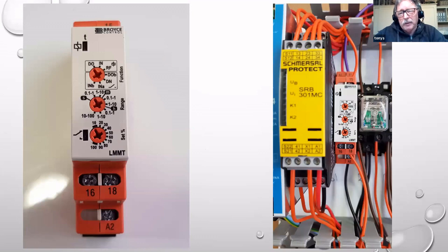That's the design principle of this watchdog timer - it's independent of both the ARM chip and the code. On the left-hand side I use a simple DIN-mounted universal timer. These timers have a knob to set modes like time-delay-on. The particular one I use is looking for an input change of state - it's edge-triggered. A lot of timers will stay reset if you hold the input high, but this one actually looks for a change of state, so if the code doesn't produce one it will time out and open its contacts.